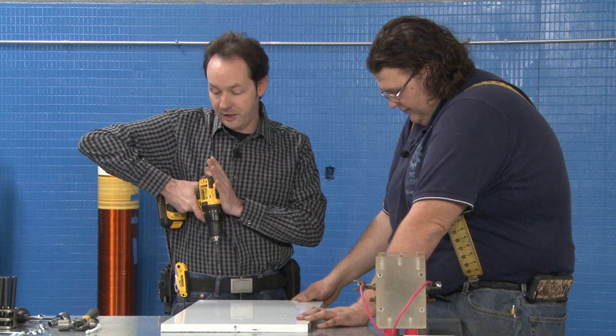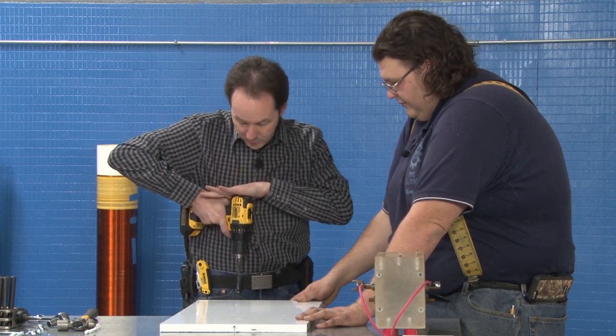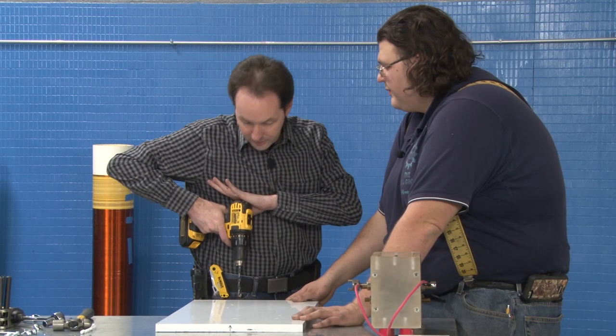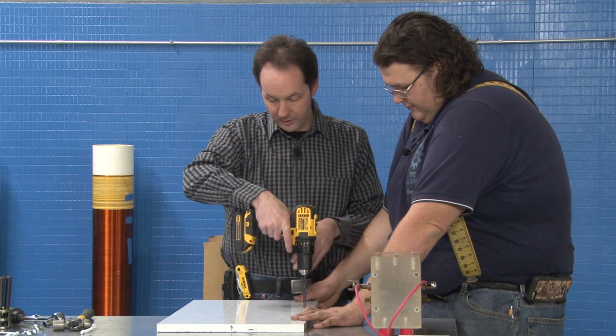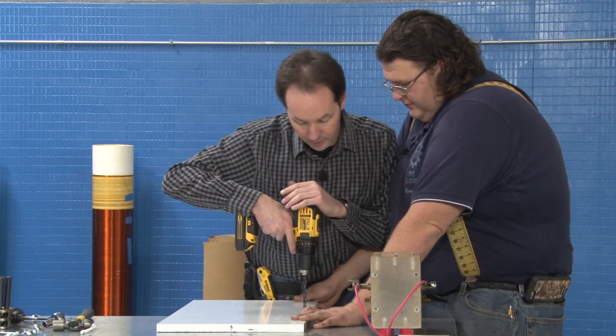So that'll just kick in, and you have control on axis of the drill. This hand is applying pressure down, and this is the hand you're using to actually drill. I put my whole body in it. I park it right up here and then lean with it. So knowing what you know now, watch how I drill this hole. The inside ones I can't lean on because I've got to get so far over, but you just cuddle up close with Batman.